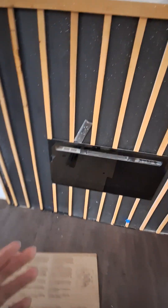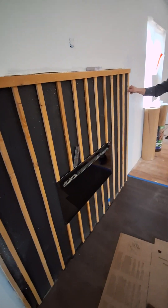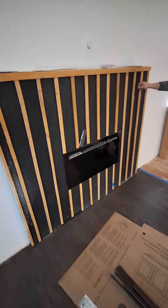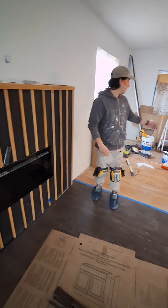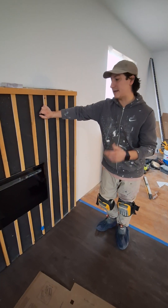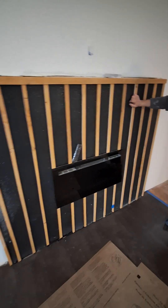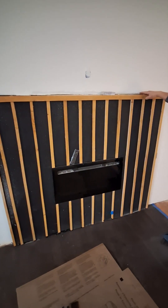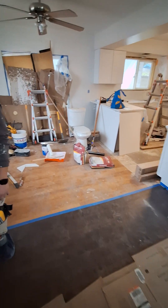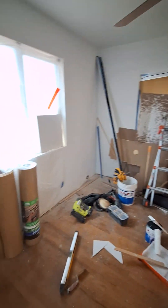This is the high-quality stuff. You've got the gas fireplace — you guys said you're going to tile this instead. We're going to paint it black and trim the bottom. We have a lot of extra tile and Hardy backer board, so we might as well nail it down and tile it — it would take about three hours and it would look a lot better. We're also thinking about doing a marble shelf here. Pro tip: try to get a remnant piece — something left over from another job — you can get them super cheap.